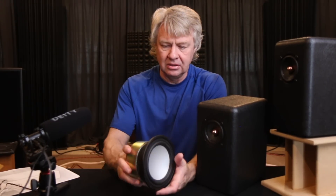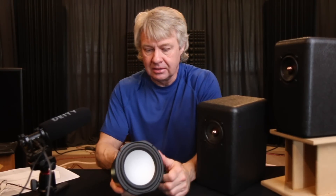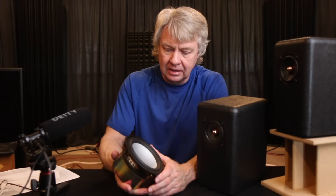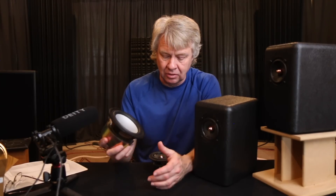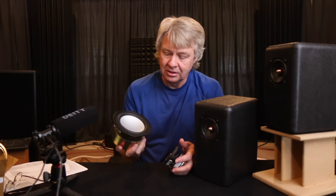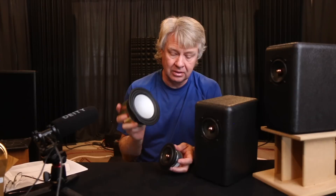We came up with this idea: we've got a lot of these little woofers that I got as a buyout, and we did a little speaker with these called the desktop mini — we used one of these and a little metal white dome tweeter, got all of them in a buyout auction. We priced these things stupidly cheap as a loss leader and sold all of them until we ran out of tweeters. I still have a bunch of these woofers. So we got to thinking — this is a great application for keeping the box skinny. With the truncated sides we can keep the box skinny and mount a little LGK driver right over it, cross it at a low frequency range, and allow this thing to be just a woofer. This thing works really well just as a woofer — the vocals in this LGK are phenomenal. We want to hand off to this as soon as we can, but let the woofer take the load and play the low frequency.